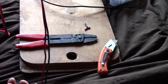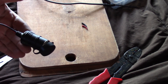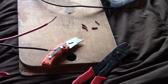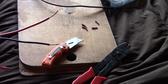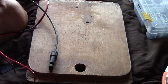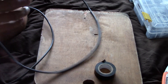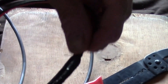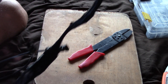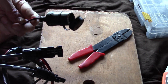I'm going to make sure I cut them leaving plenty of room so I can reuse the clips again. This is a nice heavy-duty socket so I don't have to worry about it in the weather. Didn't even lose a strand — so there we go, I have the ends for the socket stripped. We have a pair of butt connectors here so we're going to go ahead and use these. One crimp done, that's one connection done. I'm going to electrical tape it — there we go, that'll make one good strong connection. Generally what I do for strength is tape these together. There's the final product, all taped up so it's nice and strong. These other connectors were already on the cable so they're strong and waterproof — shouldn't be a problem.